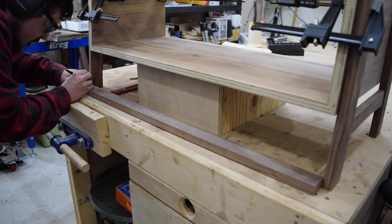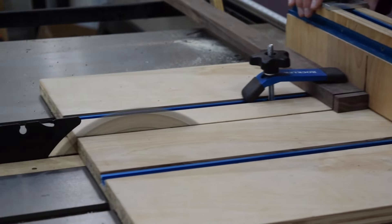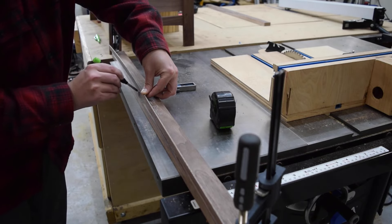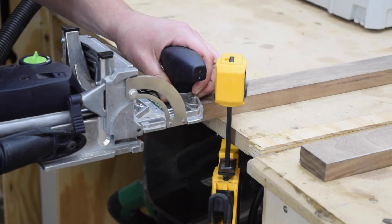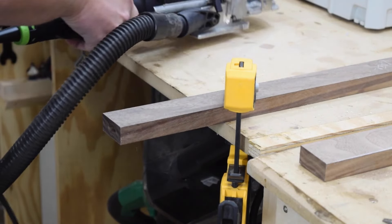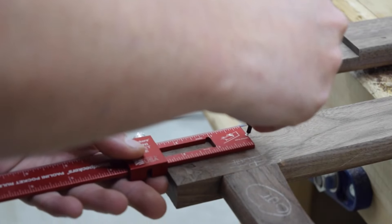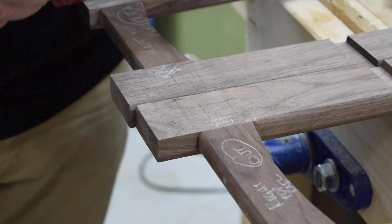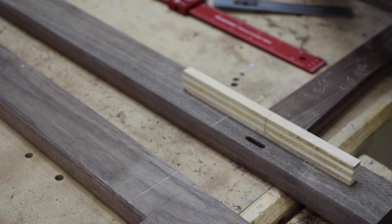Once all of the dados were cut, I turned my attention to the lower front and back rails. I made a small box for the carcass to sit on and marked out the cuts and cut them on the crosscut sled. I again marked out the curves using a strip of wood and two clamps. Since centering the domino placement after the curve is cut is more complicated, I plunged the mortise into the rails first. Next, I marked the mortises for the lower leg assembly. Since the mortise sits on the face of these pieces, I used a square strip of plywood and some double-stick tape to locate the center point and give me something to rest against. Then I plunged the mortise.